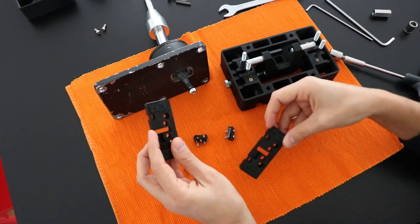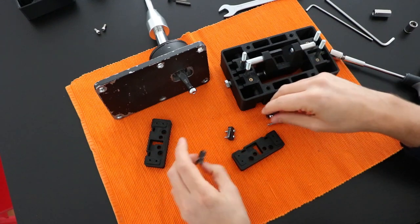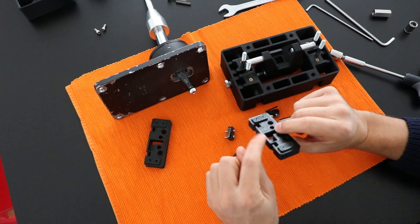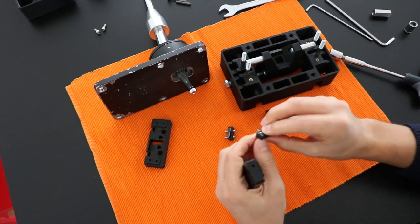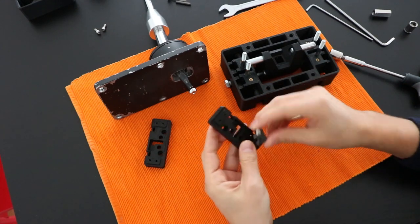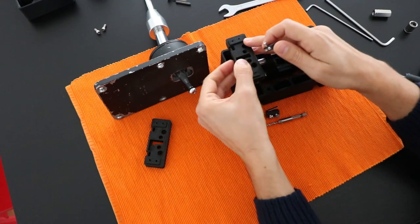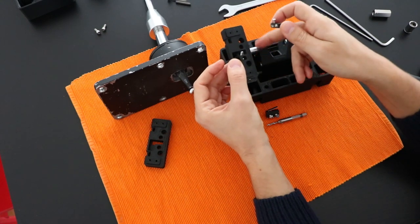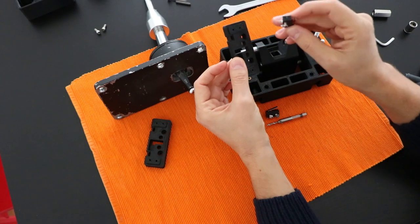So now I will assemble it, because there is one trick here, which is the middle switch. The middle switch needs to be assembled first, and it only needs one screw, because I didn't have space to put the second one. These bolts here for the engagement of the gears will pass really close to the switch.